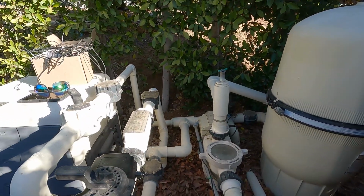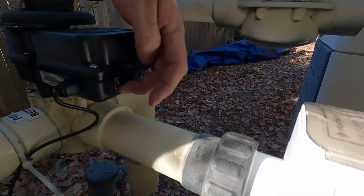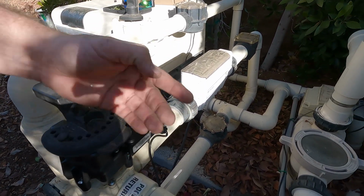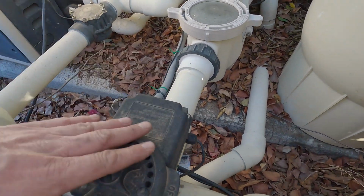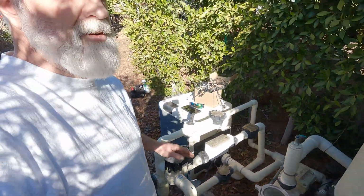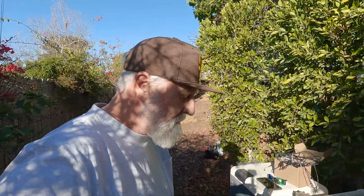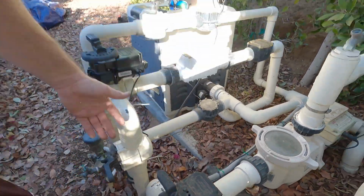And so yeah, I'm feeling good about this. We put it in position 1, right? That's what mostly you want. And so then we have it backwards, because that's with our 180 right over here in position 1. We were here on pool, and then when we put it into spa, position 1, both actuators in position 1. And that's done at startup. So the plumbers who put the actuators on, or whoever does that in the pool company, if I put that on wrong, all I have to do is flip the switch, and then there you go.